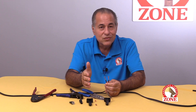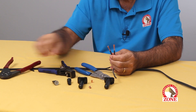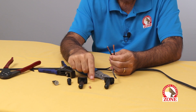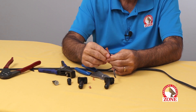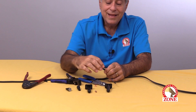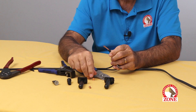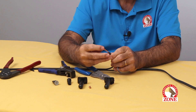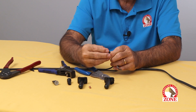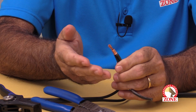We have the copper crimp. We're going to gently join these two ends together — that's to control the wire strands so that when you're sliding the crimp over, you don't get a wild hair going off and wrapping underneath the crimp, failing to get into the splice. That's perfect.